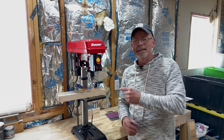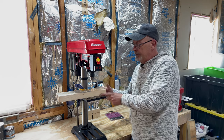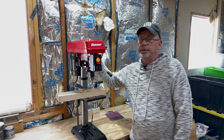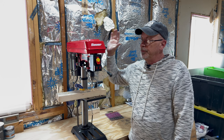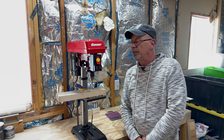That's my final word on this Harbor Freight Bauer 10-inch benchtop drill press. If you're looking for a drill press for your shop that you can afford, this is the one. It's smooth, it does exactly what it's advertised to do. I haven't drilled any steel with it yet but I will — at the slow speed of 640 RPM with a little drill oil you should be able to drill through mild steel without issue. My review is five out of five stars. It drills holes and it drills them with precision. I'll put a link below to the Harbor Freight site.